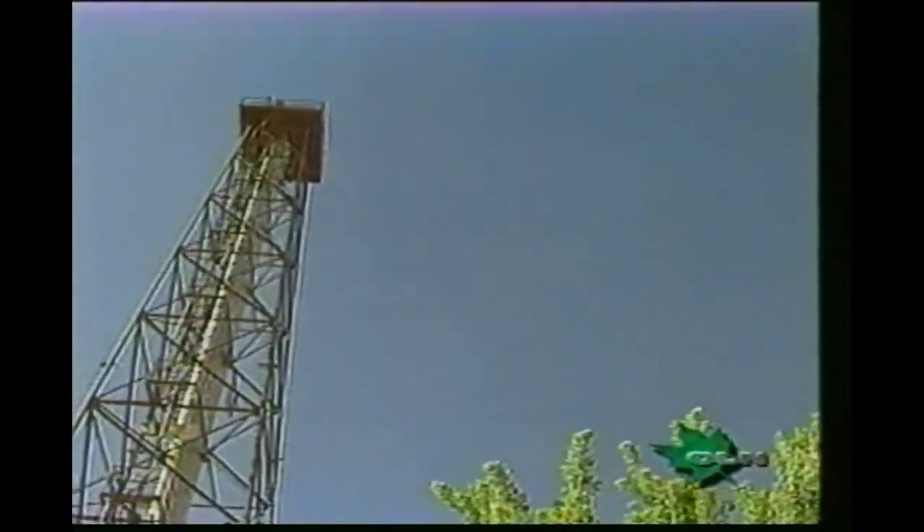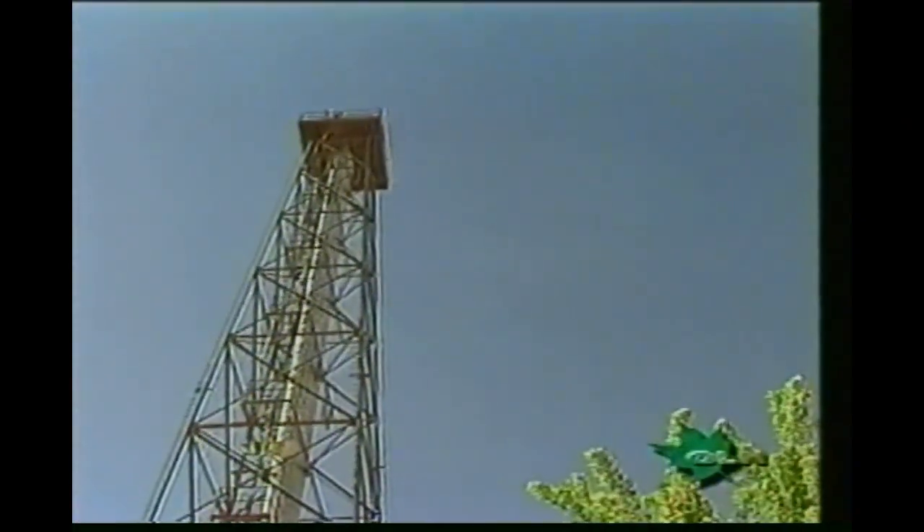The hole is actually a lot smaller than the finished piece of shot made from it. The lead is poured in and falls down through a large pipe on the tower. The reason for the pipe is to block the wind — just to keep the wind from blowing the shot into each other while it's still in a liquid state. It may take the first 30 or 40 feet to just start to become solid, and wind can cause it to connect together before it is solid.